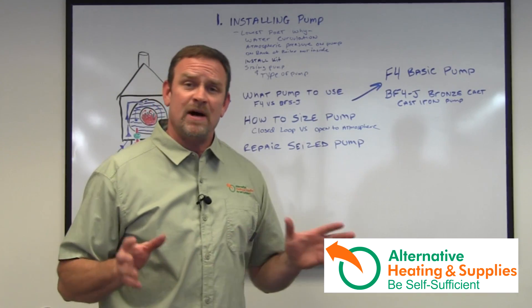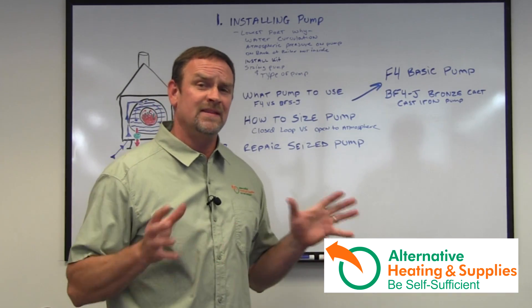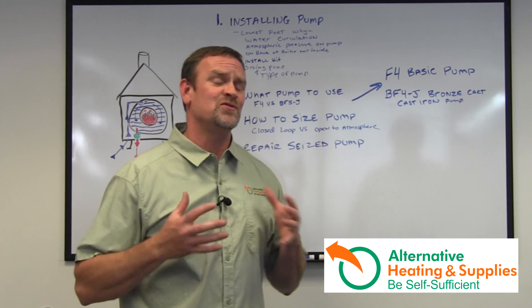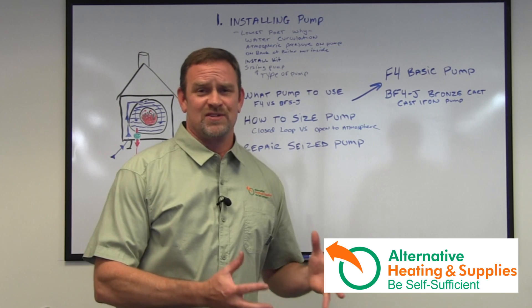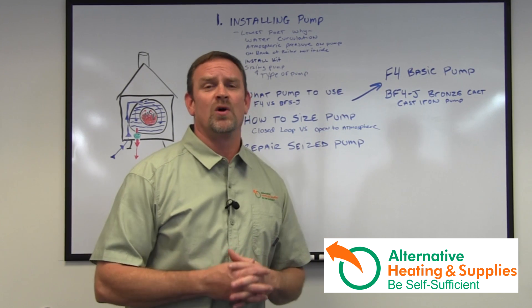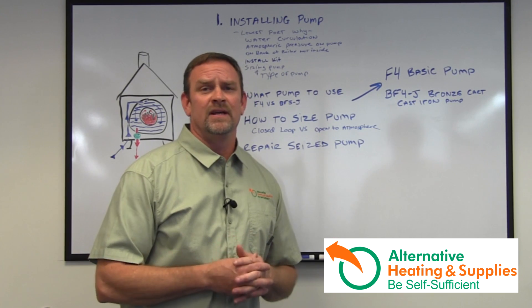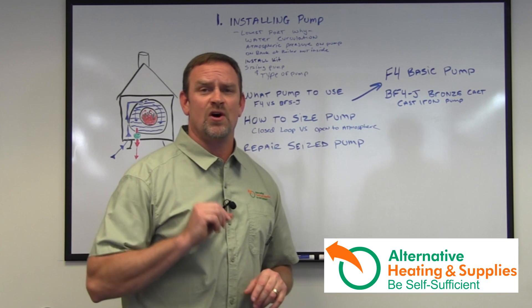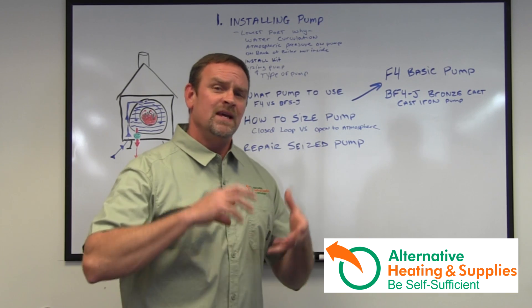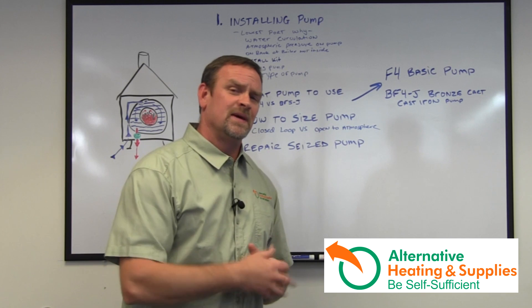That's basically the basics of a pump, but this is important: when your pump fails, you've got no heat. So don't go out and buy yourself a cheap pump, because when that pump goes down, you're down — that means you're not heating. Buy yourself a good quality pump and take care of it. In the next chapter I'm going to talk about a seized pump — when you turn off your pump for a long period of time, the cartridge sticks a little bit. I'll be talking about that in chapter 3.